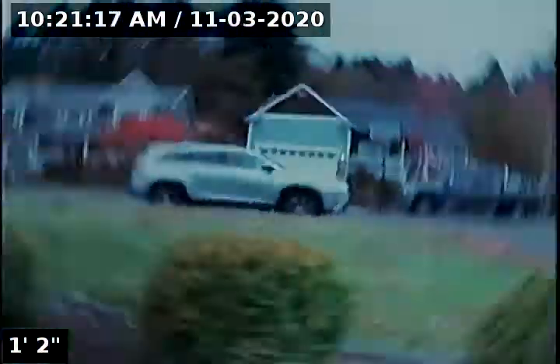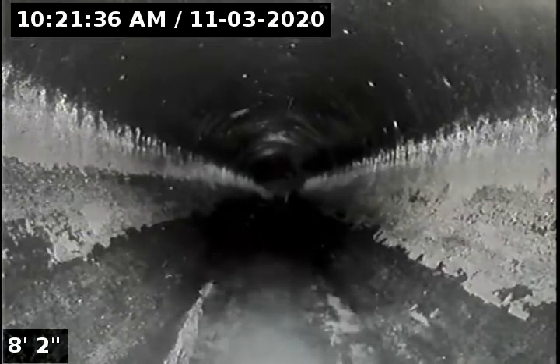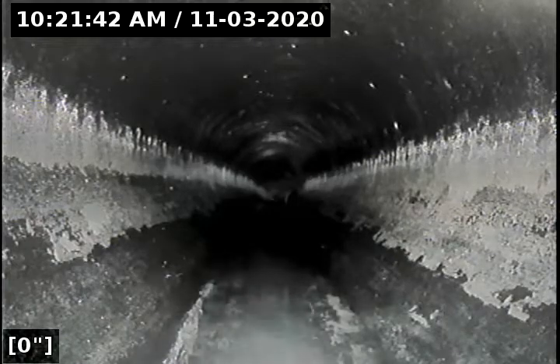The house is facing west. I have located a manhole there, which indicates that's where the city main is. Here in the front of your house is a three-inch ABS clean out — there's your garage, there's your front entry, right in between underneath your windows. I'll be accessing the line for inspection. The purpose of this inspection is to determine the overall condition and serviceability of the sewer lateral from this point to the city main.